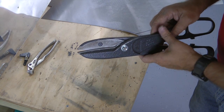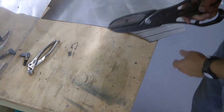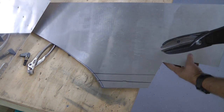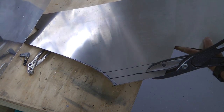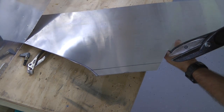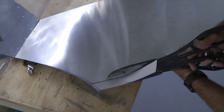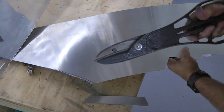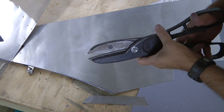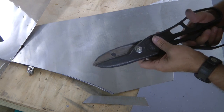This creates a clean cut and it works great on materials up to about 30 thousandths. This is 25 thou — pretty standard aircraft skin. Cutting this is almost like cutting paper. It is effortless, cuts straight, and it doesn't leave those teeth. The thicker the metal, the more energy it takes, and when it comes to curves, just like a regular pair of scissors you have to control it — but for sweeping cuts, you can't beat these.